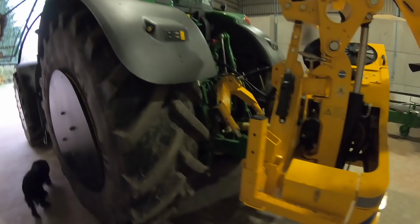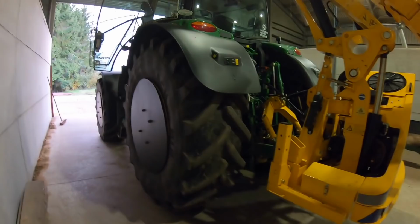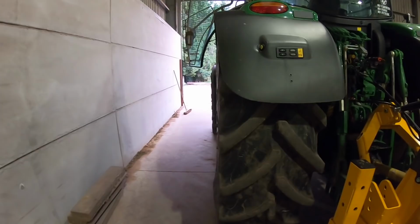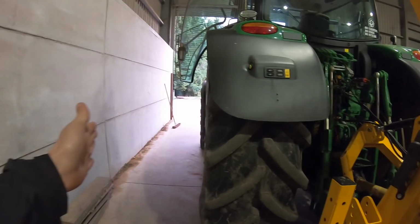And the third adjustment that I want to make is at some point go and borrow the neighbour's tractor wheel trolley and switch these back wheels around. If you remember, last winter we did the front ones. We widened out the track spacing so we could get a tighter steering lock so the tractor would turn tighter, but we didn't do the back ones.